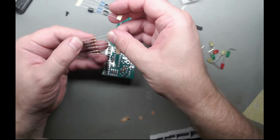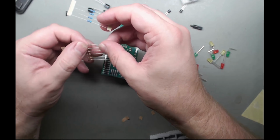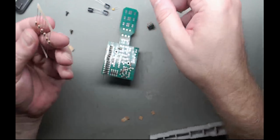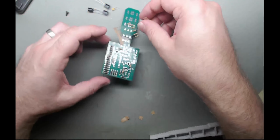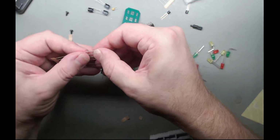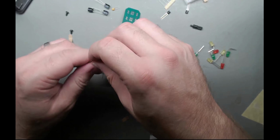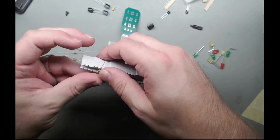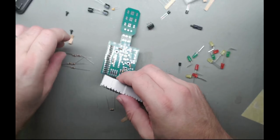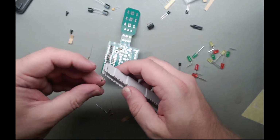4 band ones, not a problem. These are brown, brown, black, brown. So these are our 100 ohm resistors. So these ones would be these ones up top. Remember those. So they must be my 2.2k. I'm going to have a look at those numbers. Not ratings, but markings.